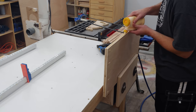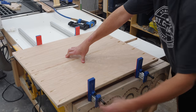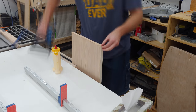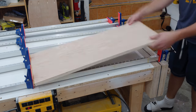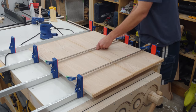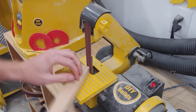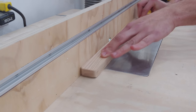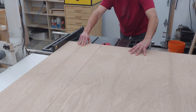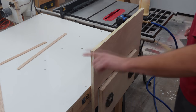The strips are glued to only the front of the 6 shelves and the 4 side pieces. The tops and bottoms of the shelves get strips glued onto the sides first, then are trimmed to length once dry. The fronts are then glued in place, overlapping the side edging. Next I cut some scrap oak to width and length for the base of the rack where the casters will attach. These pieces get the corners rounded at the belt sander and then get a quarter inch round over at the router table. I cut up the last piece of three-quarter inch plywood for the top of the mobile rack. This is edge banded the same as the shelves — front and back — before being cut to length at the miter saw.